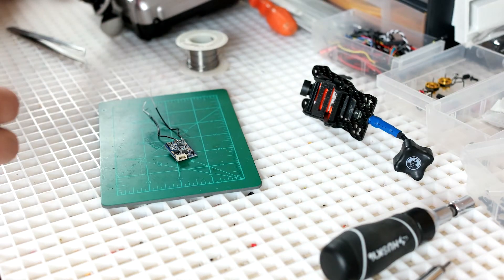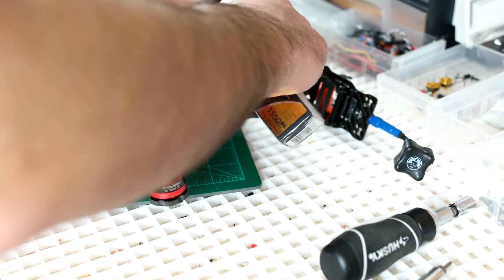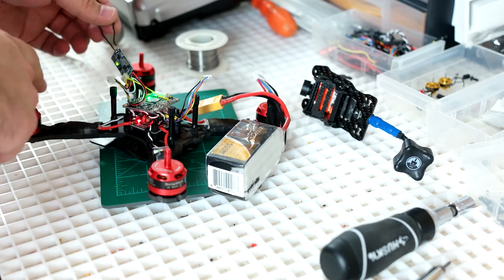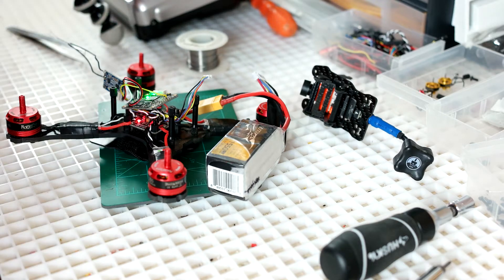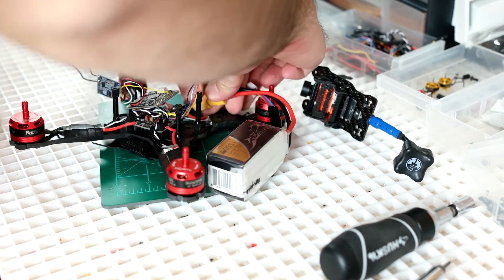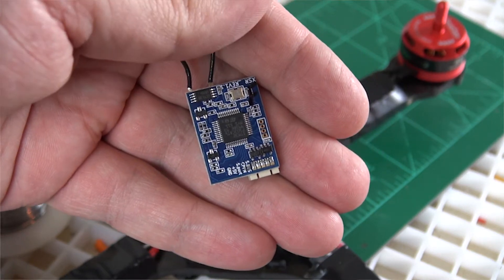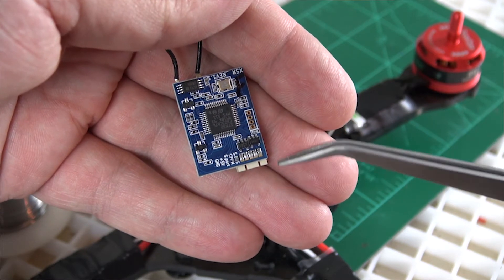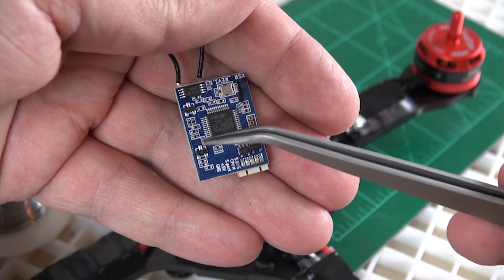Alright, that's a good sign — we're all green on here, that means we're connected. If I turn off my transmitter here it should go red. Transmitter's off, it lost connection — XSR is still good. So I've taken a look at the directions and what it's telling me is that this pin right here is actually after the inverter. So what I've got to do is take the smart port wire and put it to that pin right there. Let's break her out and solder her up. This middle yellow wire is the one I need. So let's pry this off.